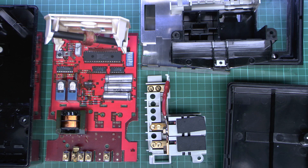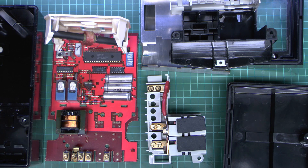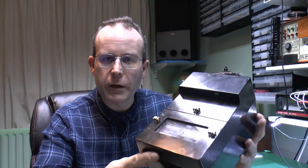So that's what's inside a radio teleswitch — this one about 30 years old, probably an even older design. Certainly very well designed and clearly optimised to be as cheap as possible to manufacture while still having a certain amount of quality — certainly much more than cheap modern meters which don't seem to be particularly well made. There are many different outputs for various switching options, and of course the two large relays for the 80 and 25 amp main switched outputs for your heating. All those metal shields, circuit board, and plastic pieces all fit together perfectly, literally just clipping in place, representing a substantial amount of design effort — and that was made in the 1980s when computer-aided design was nowhere near today's standards.